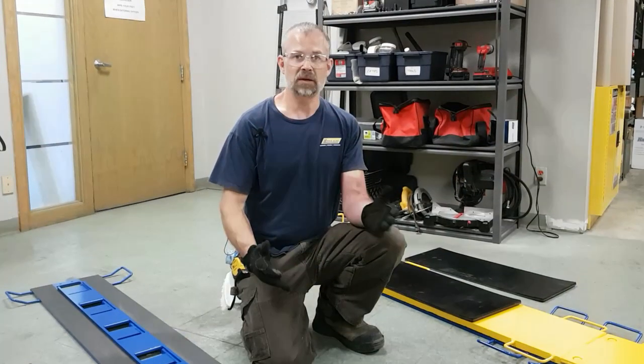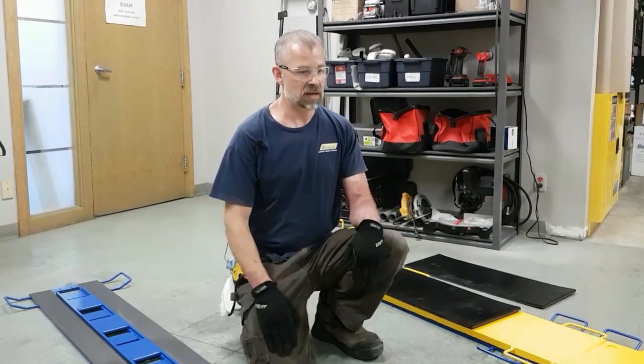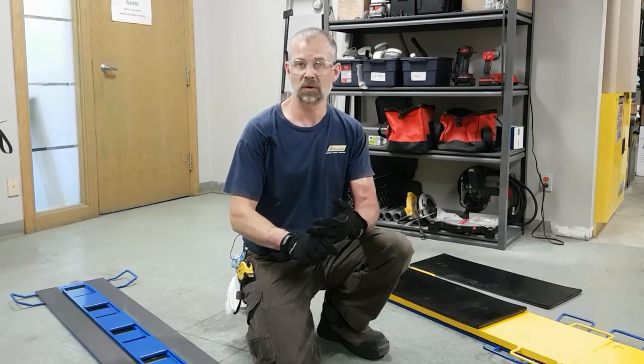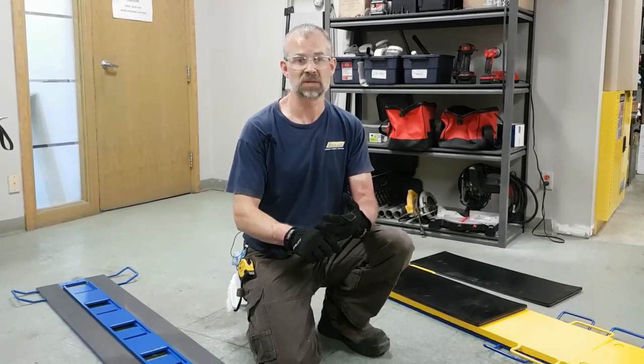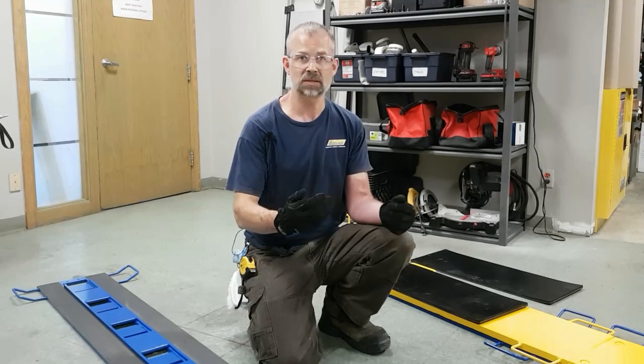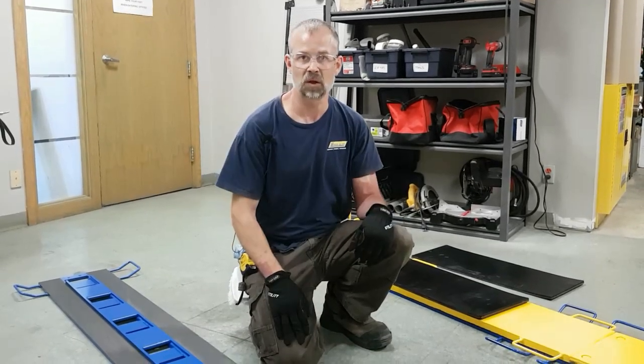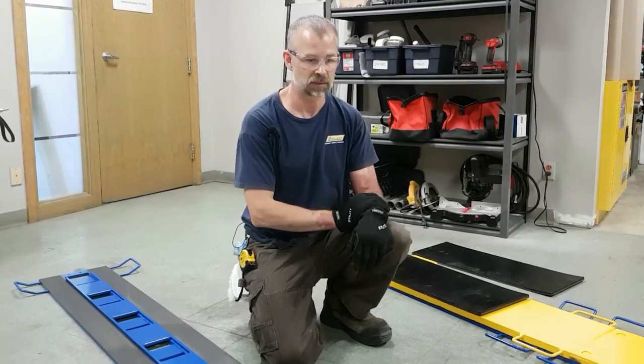So now at this point, you've got your track set up. You've got your two lines set up. You've ensured that they are parallel to one another, that they're level to within plus or minus 2%, and that the ratchets are equidistant from each other, or the ends of the tracks are equidistant from the load, so that your system will push in unison.